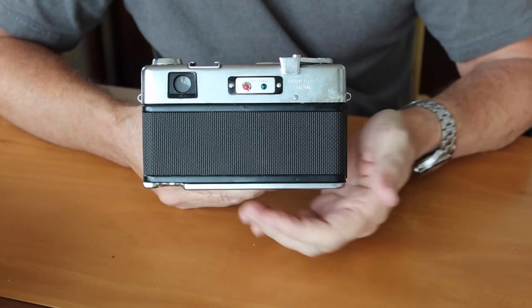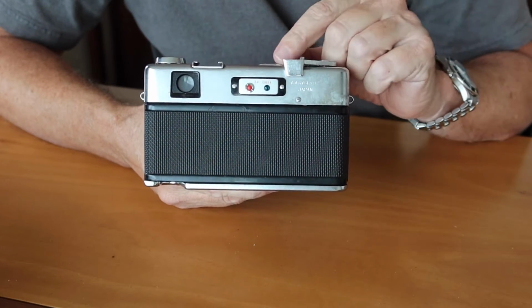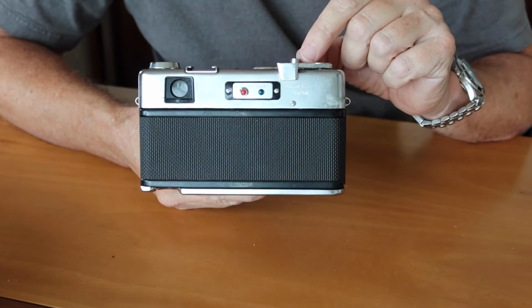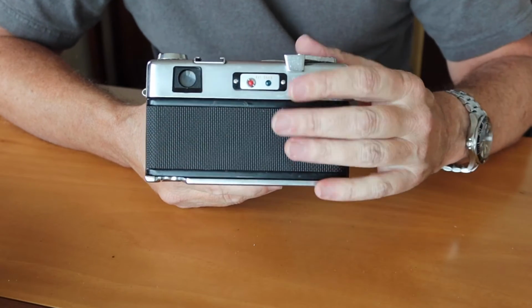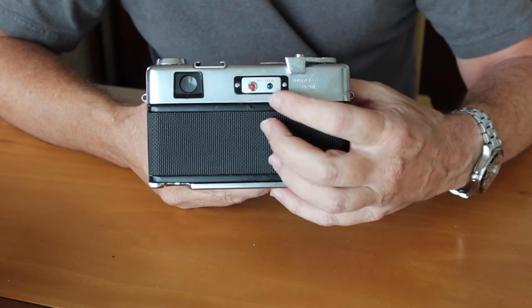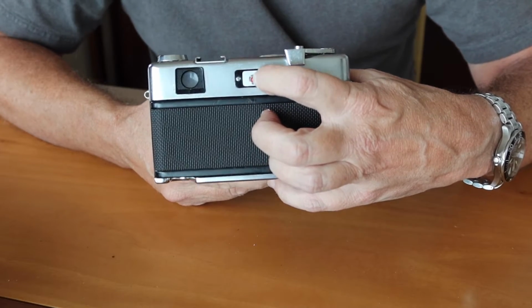So if you've got an old camera, one that doesn't work or is broken, you can use the bulbs. They're soldered onto the wire, so you have to cut the wires a little bit of distance from the bulb, and then you can solder them in place after removing the old bulb, and it'll work fine. The burned out bulb is the first cause. In regards to the battery check lamp, on these old cameras, sometimes it doesn't work simply because you're not pushing the button in far enough.